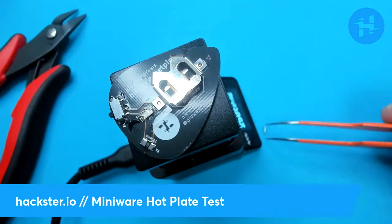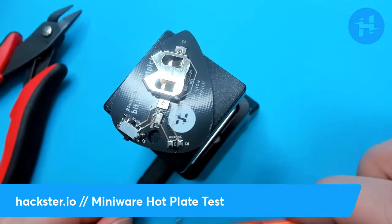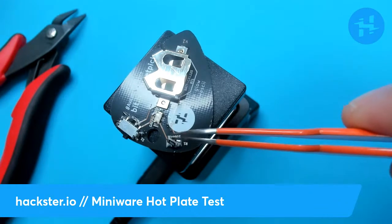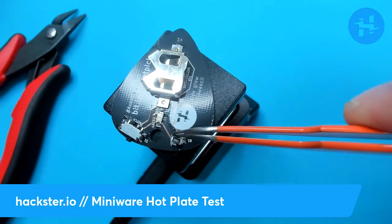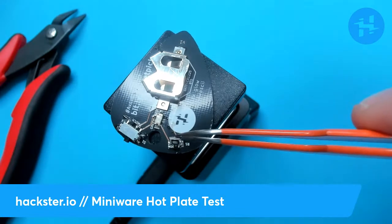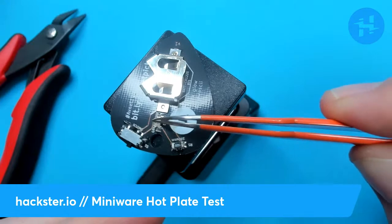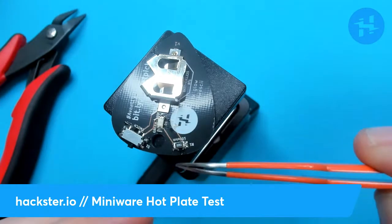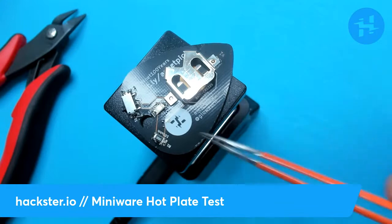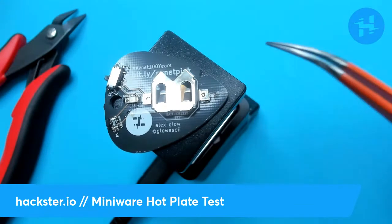But this does give me information about when I'm soldering a larger PCB — I have to make sure that I'm able to support the whole PCB and that I'm not going to end up with it falling off and spewing components everywhere, because that is not optimal. Stop sticking! That's probably because I used these tweezers to move the solder paste around — to unbridge those contacts — and I should have wiped them off better so they wouldn't stick. Okay, now go — go there and stay there. That sucked back into place — that's great. I think there's still plenty of solder on there to continue making these connections. I'm just going to make sure that the battery is in the right place and all nicely connected, and be a little bit more careful with the tweezers.